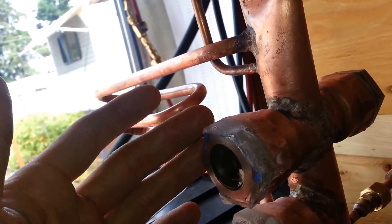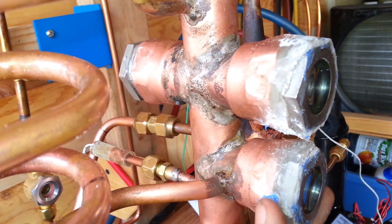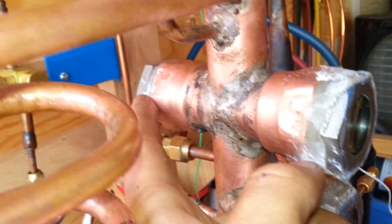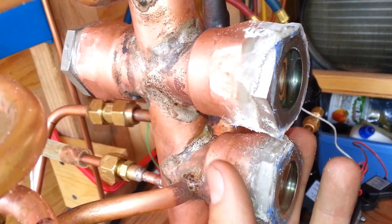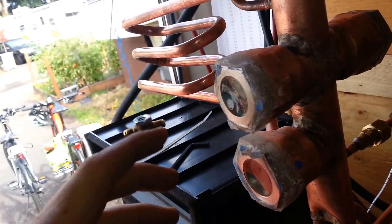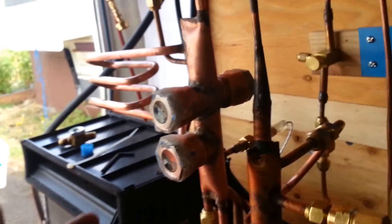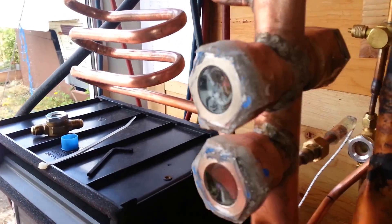You can see there's a whole mass of epoxy on there because I screwed up. I cranked them in there with some pipe dope, did a pressure test, and they leaked too much for my purposes. So I applied a little epoxy. This back one here wasn't too bad — 24 hours later I pressure tested again and that one was actually good. These two were not a vast improvement, so I decided to make a tape cone around both of them, laid it up so the glass was facing up, and drizzled some epoxy in there to kind of cast it. It's really ugly and pretty half-assed considering the amount of work that went into the whole thing, but I'll cover most of it with insulation anyway — so as long as I can't see it, I'm happy.